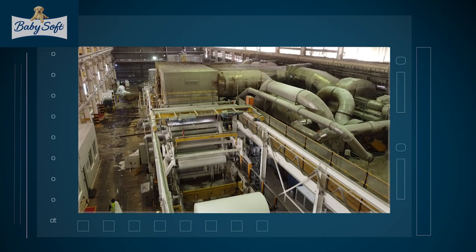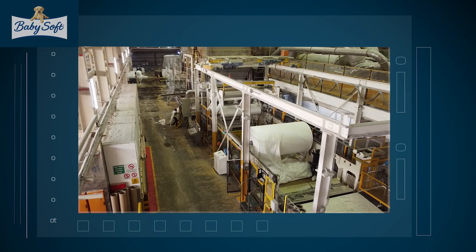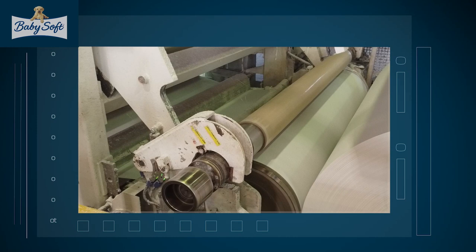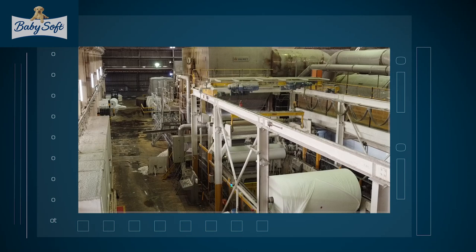When it comes out of the other side of the machine, the sheet of tissue is completely dry and is wound onto the huge jumbo reel that we saw earlier. It's about 1/10 of a millimeter in thickness at this stage. When a jumbo reel is full, it's replaced automatically with another empty reel core. This enables the factory to continue with production without stopping the machine. You can imagine what a backup you'd have if everything had to stop.